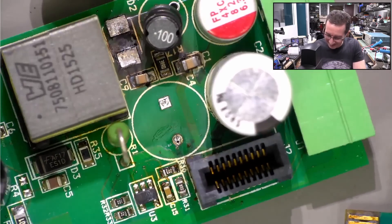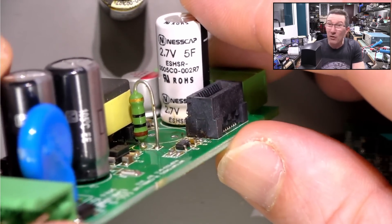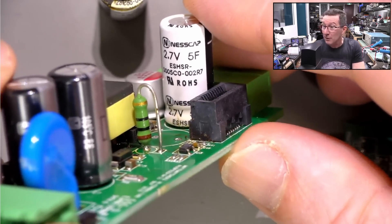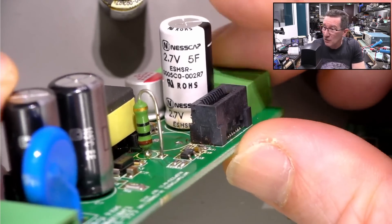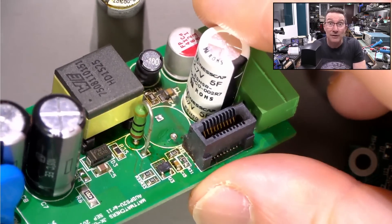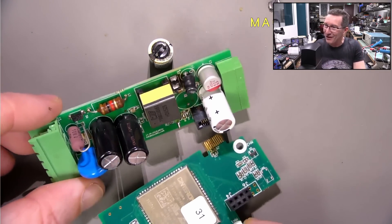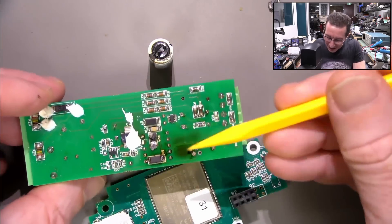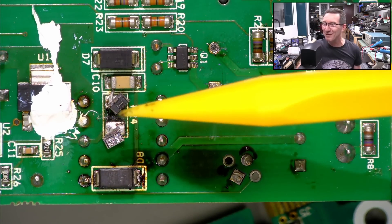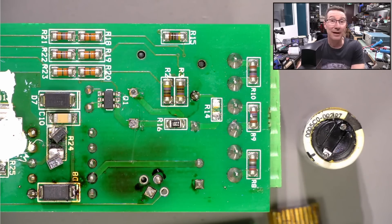I'll send this video to Solar Analytics and see if they've had any other failures of these Nescap super caps. I haven't used them before — anyone know if they're any good? All the other components in this seem top quality so I don't doubt they're normally good caps — they've just failed. Did it get too hot in the Aussie sun? My fuse box happens to be on the afternoon sun side so it would actually get hot. Super cap fire. It spewed its guts, which caused the poor diode to completely desolder itself, and then that magnificent resistor — the ceramic base snapped in half and re-soldered in the other direction. That is a great failure mode.